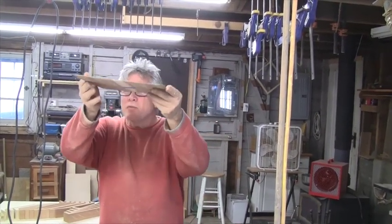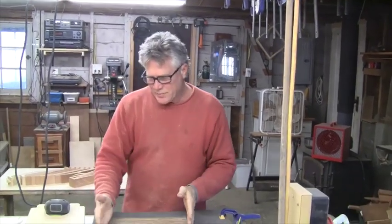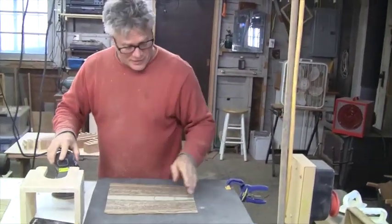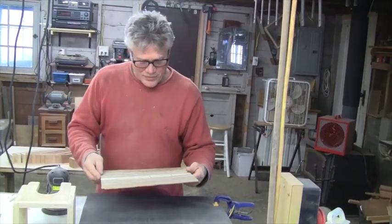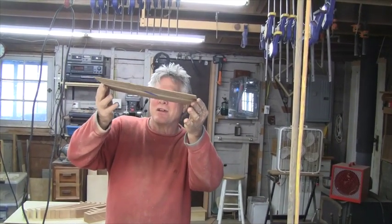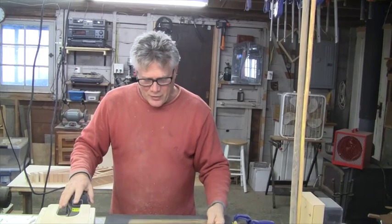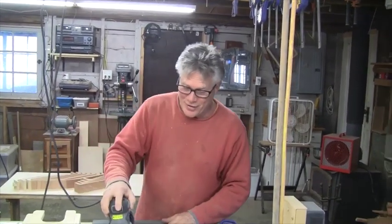I'm going to give it just a touch more. I'm using 120 grit here, and that takes out all the right-angle scratches. It looks like it's been buffed by a buffer — you can't see any scratches whatsoever. Normally I'll do it this way, turn it this way, redo it, and then it's usually done.